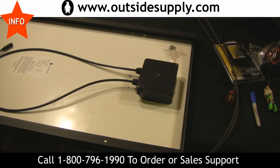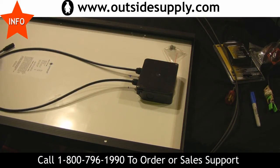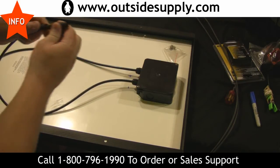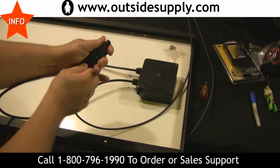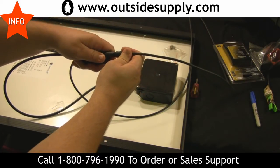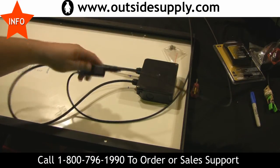They'll be both two male to one female and two female to one male connectors — look a lot like this. What you would do is undo from your cable to the array and merely plug in there, then take the cable from your second panel and make the connection, then plug back in the cable from your array. Makes a nice watertight quick connect connection using the MC connections.